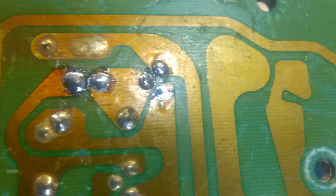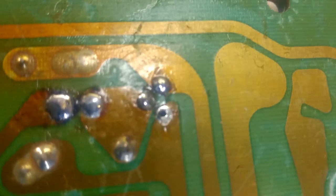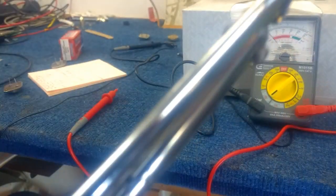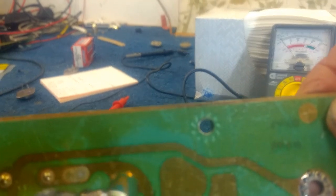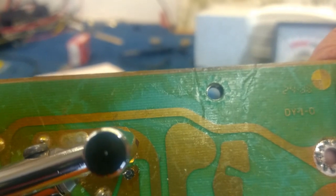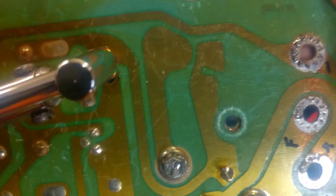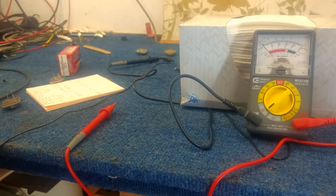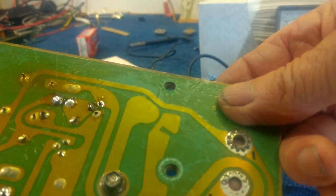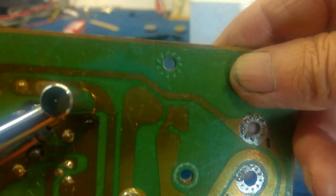See how it's sucked the solder out of there? The wire is now free. Now I'm going to do the same thing on the second of the three wires on the small sensing transistor. Squeeze the plunger, center it onto the wire until it melts the solder, then let go. Sometimes it doesn't work perfectly because I'm trying to hold the board and do this in front of the camera. I got a lot of it out, but not all of it. Trying to be careful not to ruin the component.